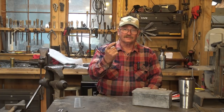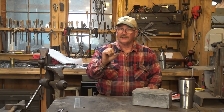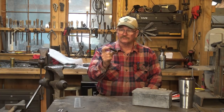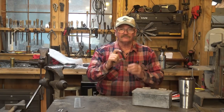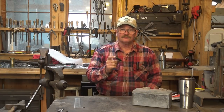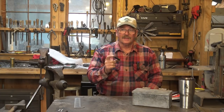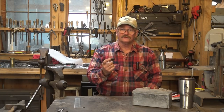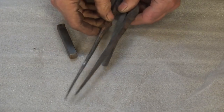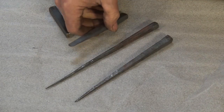What can a blacksmith do with this little piece of steel? It doesn't have to be mild steel — if you want to make a tool, use half-by-half tool steel. You can make functional tools with this. In my previous video on the concept, I started off suggesting that perhaps this was a good thing to just practice tapering out of: square, octagon, round.